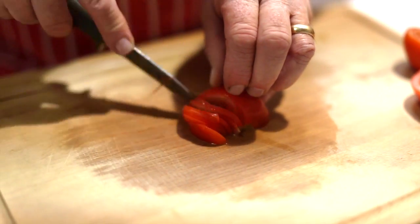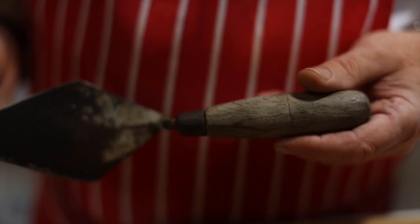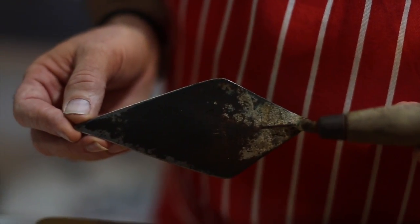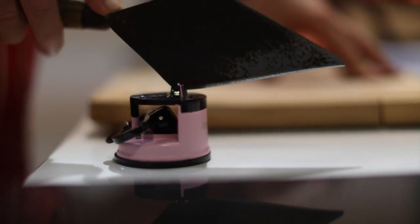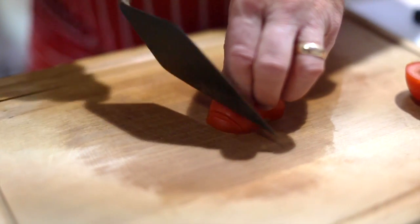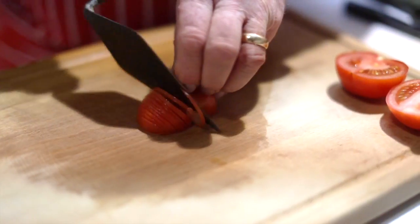The other type of carbon steel you get is drop-forged carbon steel — this is incredibly hard. This is a pointing trowel, made from drop-forged carbon steel, and the regular job is to crack through bricks and rake out cement joints. I put a cutting edge on this from scratch and it took me 10 minutes, just to show you that no matter how blunt your existing knife is, no matter what steel it's made from, if you can do this to a trowel in 10 minutes, the bluntest kitchen knife you have will be razor sharp in just one or two minutes.